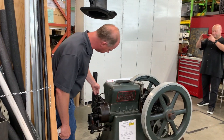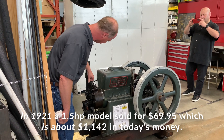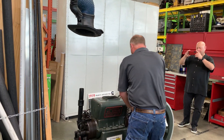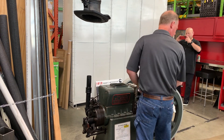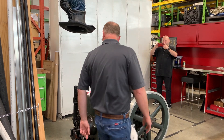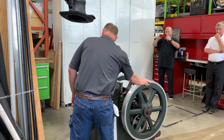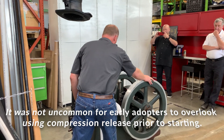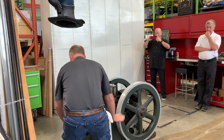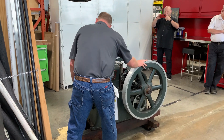This is the speed control mount — it controls the fueling. We've had it closed while it was sitting, so I'm going to open that up. I'm going to rotate the engine over a few times with the compression release open, make sure everything's working freely. Now to prime the fuel system, I'll come up to top dead center, close the compression release, put the cylinder back a little ways, and push down to draw some fuel into the cylinder. You can see a little bit of vapor coming out — that's a good sign.